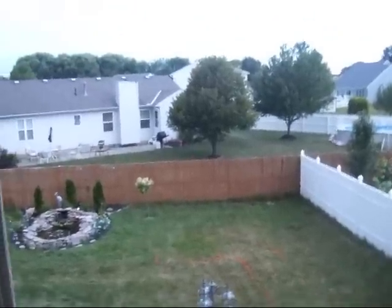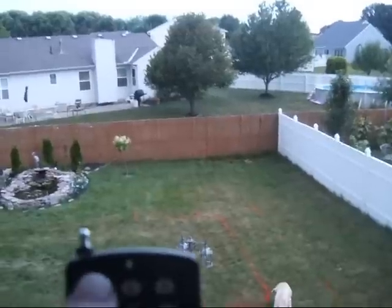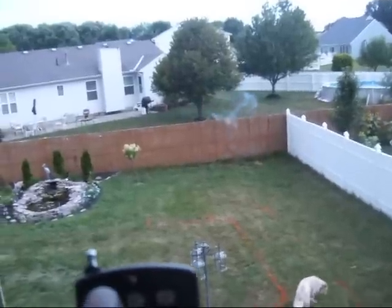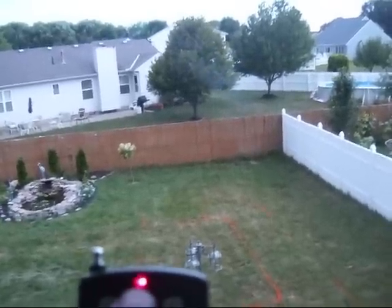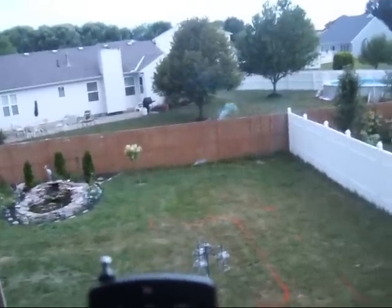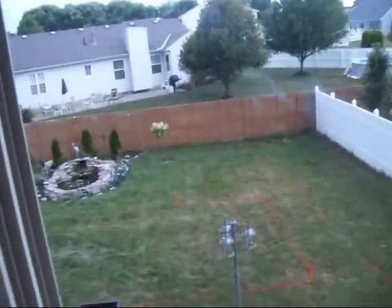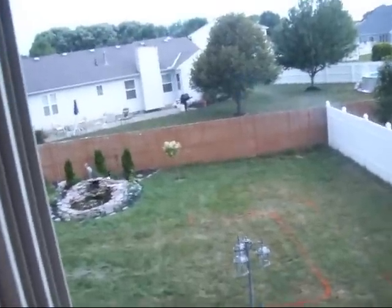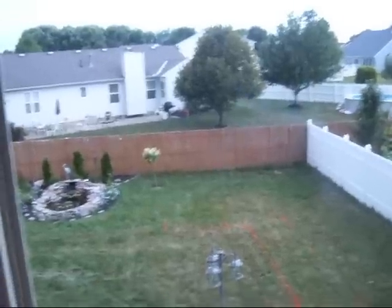Let's see if we can see smoke when I fire this off. I'm going to fire the first cue — we should have two igniters go off. In three, two, one, firing. A little bit of a delay on that. We're going to fire the second one. In three, two, one, firing. So they both fired off. Always make sure you've got fresh batteries in both the receiver and the transmitter so you can be sure you'll have very quick ignition and won't have to hold the button for very long.